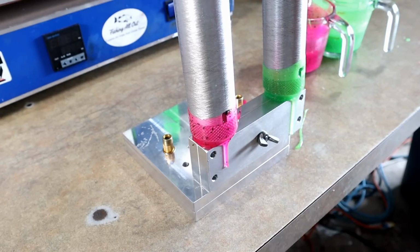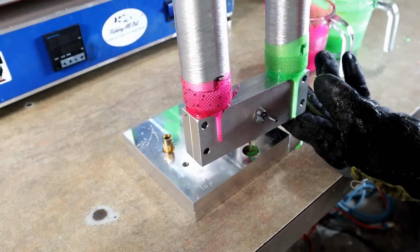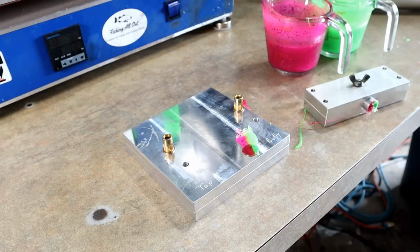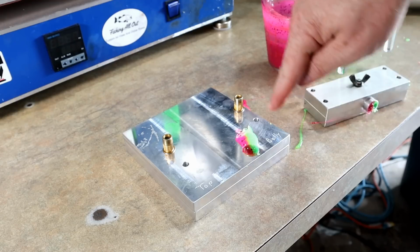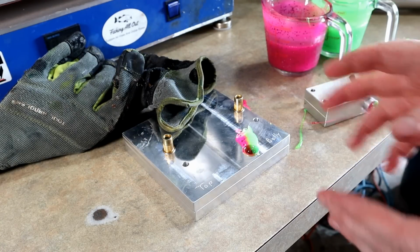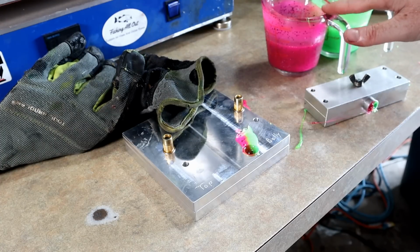Okay, and again, you want your viscosities of both colors, both sides, to be as even in temperature as possible so that you get a good even flow of the plastic, which is true for any mold that you're going to laminate. Just this one in particular, since there's really no gravity assistance in the two colors going down into the bottom of the runner and then coming up, the only way that this plastic can get where it needs to go is if you push it in there, right? And so just the way that the runner has to take this wild path, you really need your viscosities the same, which generally means your temperatures need to be within like a 5 degree margin of each other.